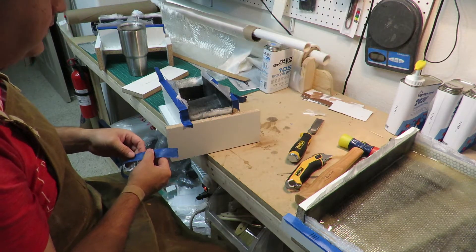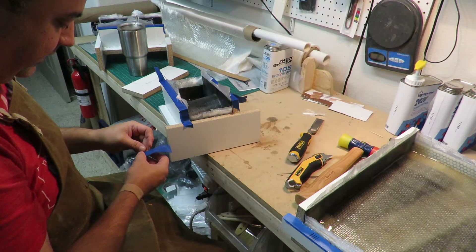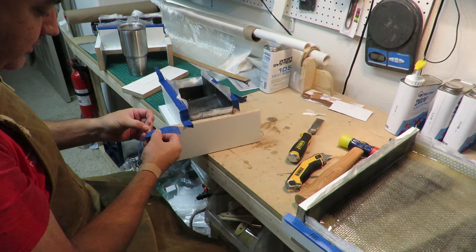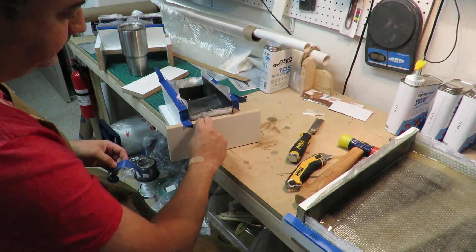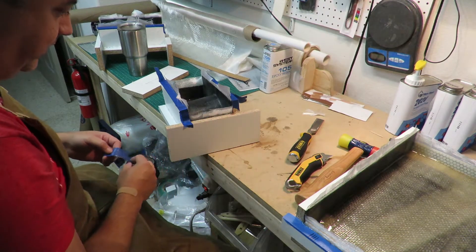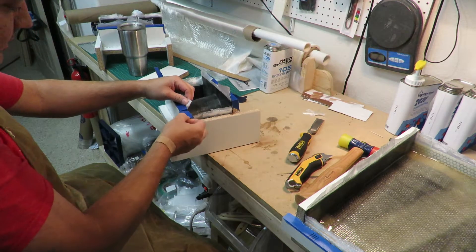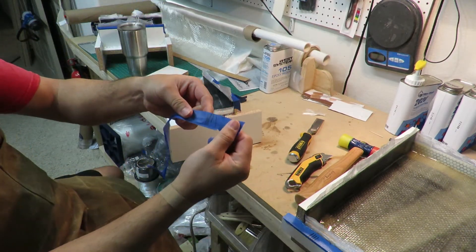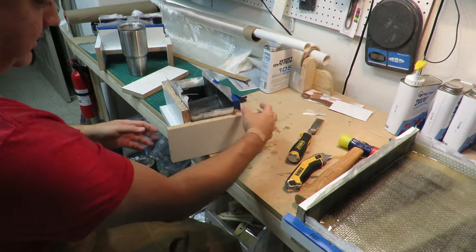An exposed edge — when I was putting on wax and PVA, these little bits of particle board were always blowing up and getting loose, and mucking up the works when it came to polishing and waxing. So I just put this tape down to keep all that to a minimum. It also gave me a place to write — this is a piece of tape where I was keeping track of how many coats of wax I was putting down, because I had so many molds going at the same time.